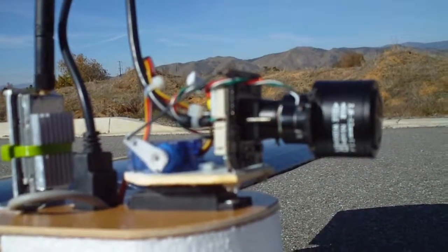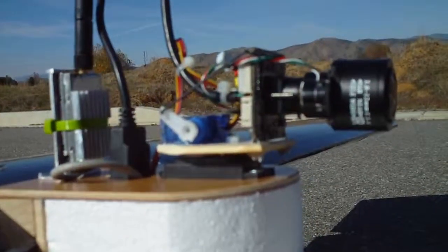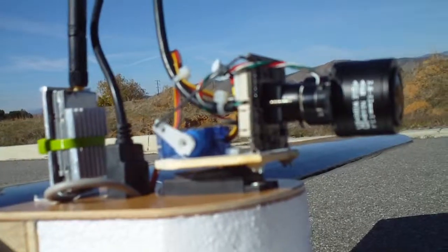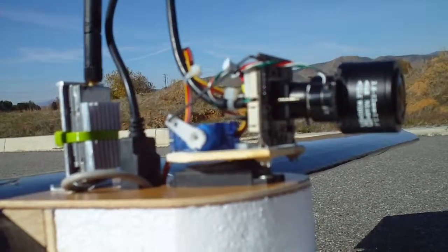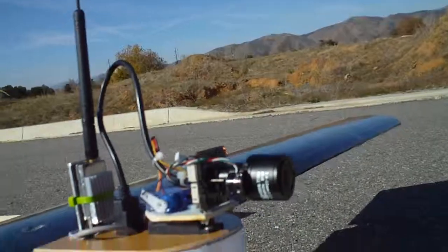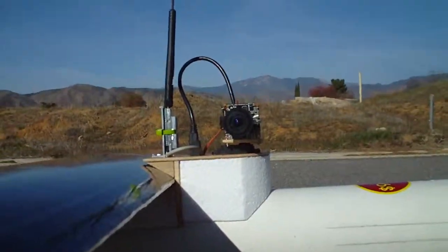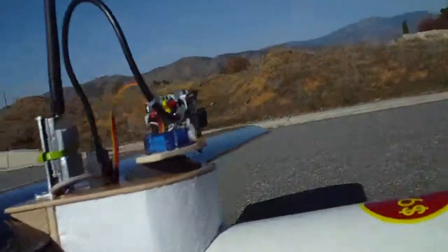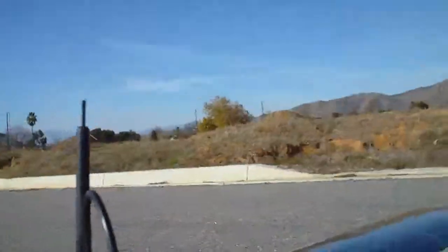Here's my pan-tilt solution — way down low profile, and that's what I was after. I wanted to keep it as low as possible. I bought from Flytron a 180 servo extender plug-and-play, so it comes with plugs on both ends and a little circuitry board in the center that does all the conversion for you. I actually get more than 180 degrees, so that's pretty sweet. I like to be able to see my control surfaces moving.